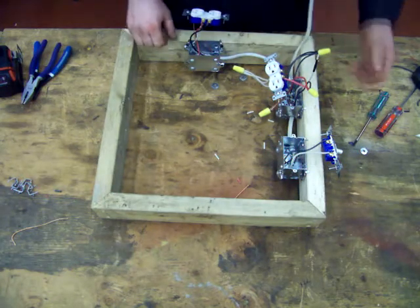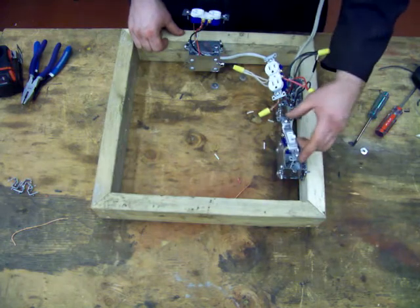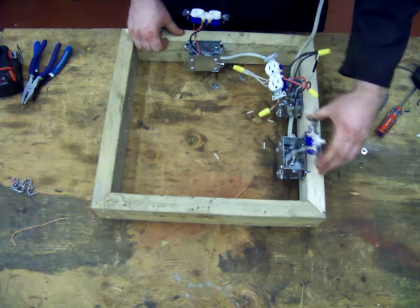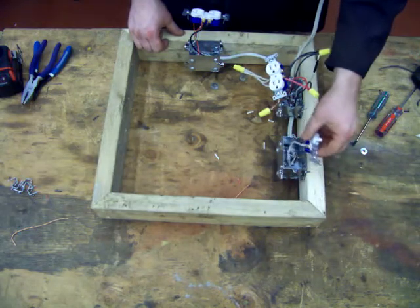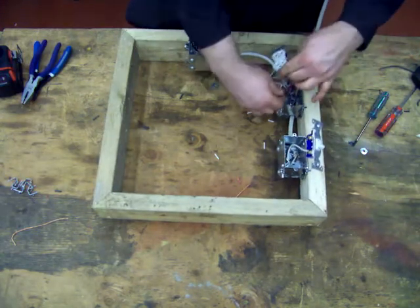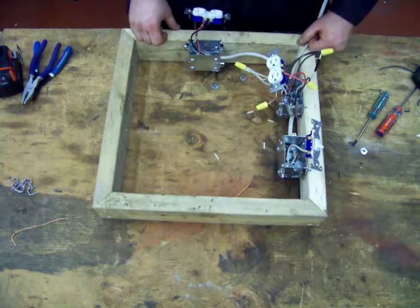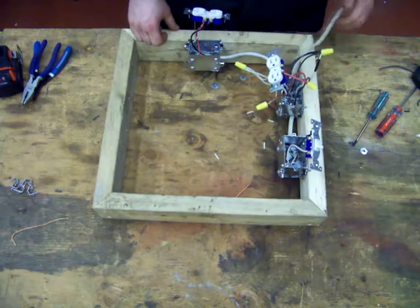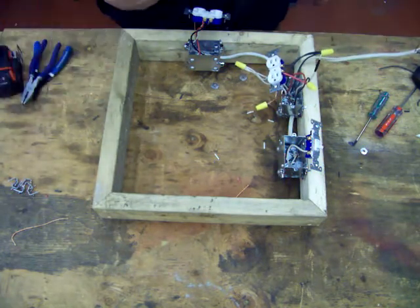And last, we have everything grounded. We got our bond on the box. There's no bond on the light switch. It is grounded, bonded through the screws in the box. Got all our ground pigtailed here, and our box is bonded, and this box is bonded as well. We'll hook it up to some power and we'll test it using the circuit tester.